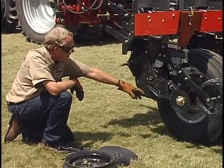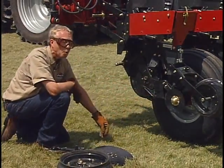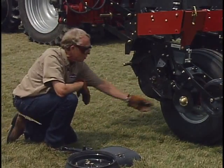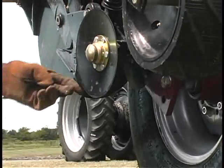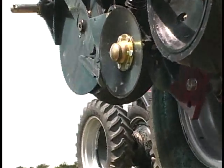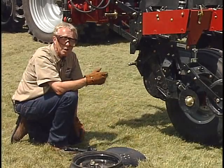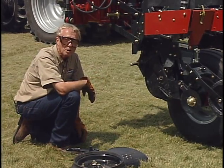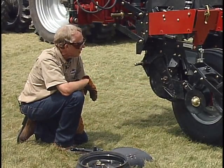While you're in there, similar to some other planters, on this planter we have a furrow firming point, and we've got a replacement part here. This furrow firming point actually creates the little dimple or V-cut in the seed furrow, and this is a wear part over time. There is an adjustment meant to be made as that firming point wears, and it's a replaceable item — something that can be checked. Certainly when you've got enough wear on the beveled edges or off-spec on the seed openers, you'll want to replace that furrow firming point.